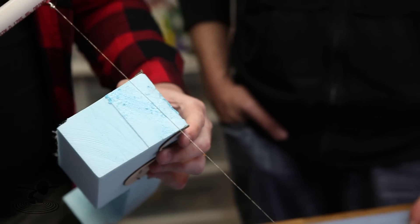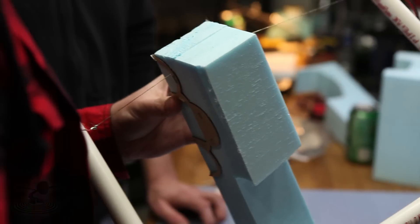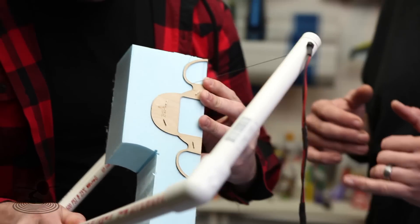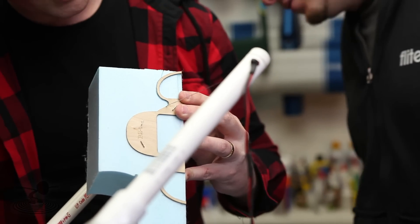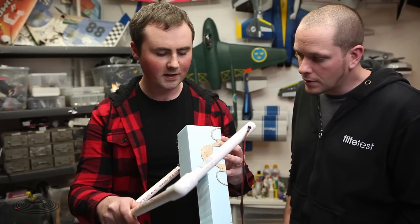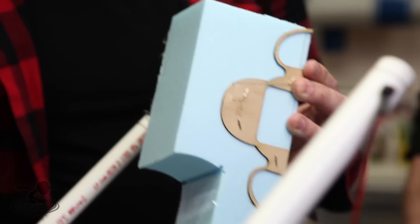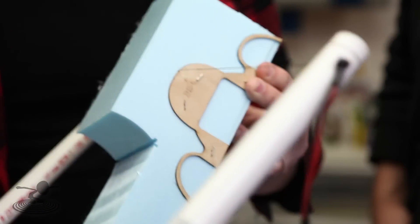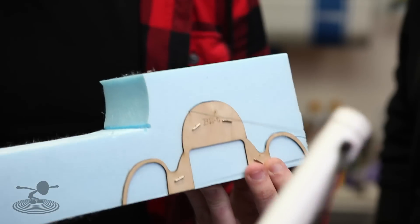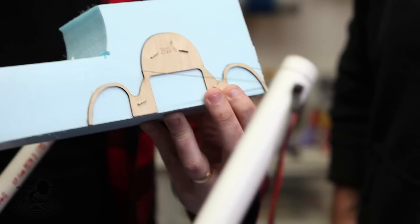You should never start right on the template, because it's going to cut more than you think. Always start at some other place and then work against the side — then cut in. Look at both ends and make the wire ride on both pieces. It's really easy — just follow the lines. The bow doesn't really matter because the wire is riding against those two template pieces; it's straight between them. Just slow down and wait — never ever stop, because stopping makes a visible line.